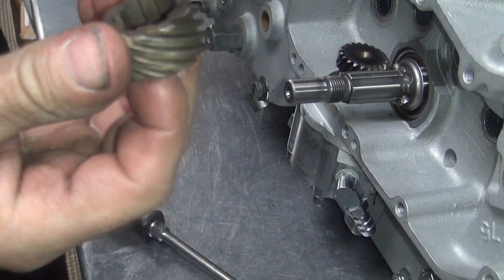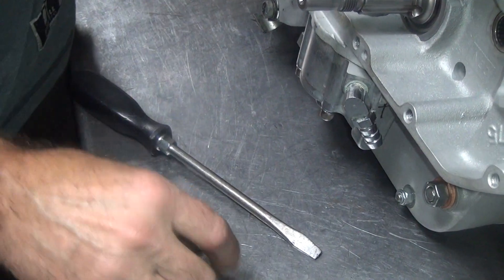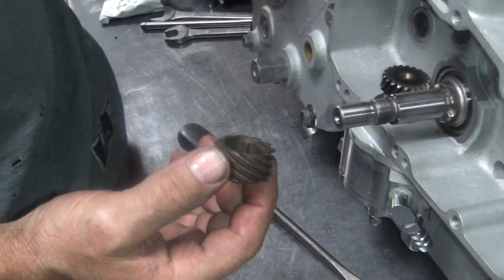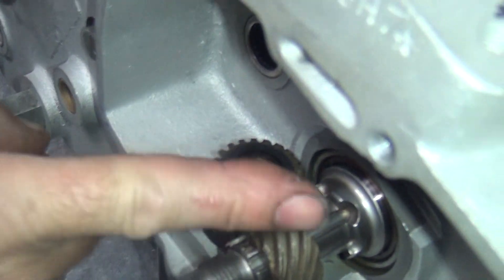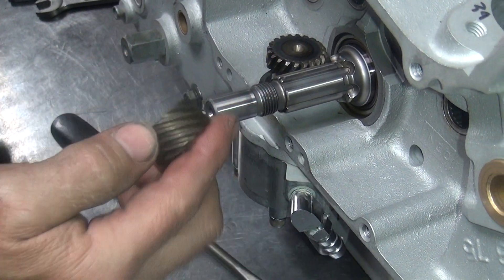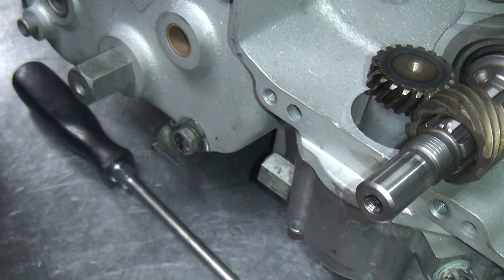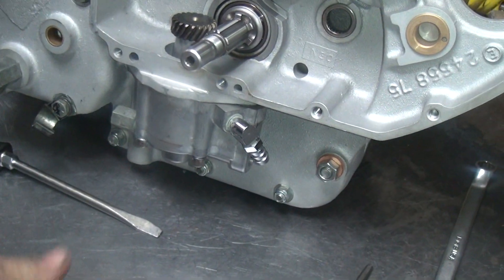It's the wrong gear. They make these in two different rotations — this is the wrong rotation. So this was the gear that had the correct number on it, but obviously it's a mismatched part. These here are opposites — that one goes the other way. That dog don't go over there, so this doesn't work. You can't turn it around or nothing — no, it's made wrong. If you actually look down the teeth, you see how it's going at the wrong angle, trying to dig in the wrong way. That dog don't hunt. So we have to find the old gear and check it out and make sure it's good. We'll be back.